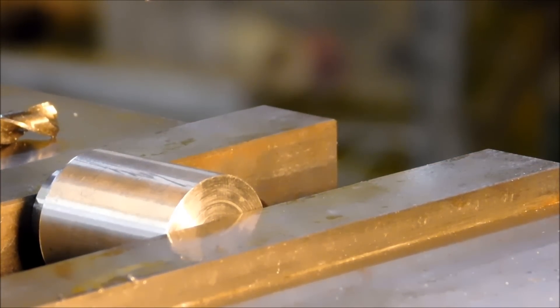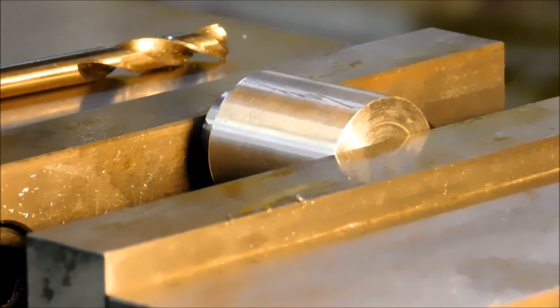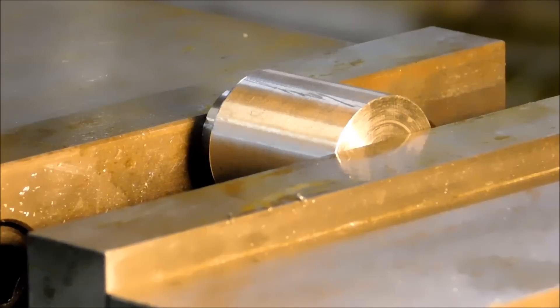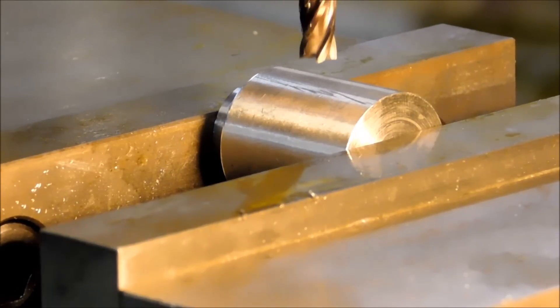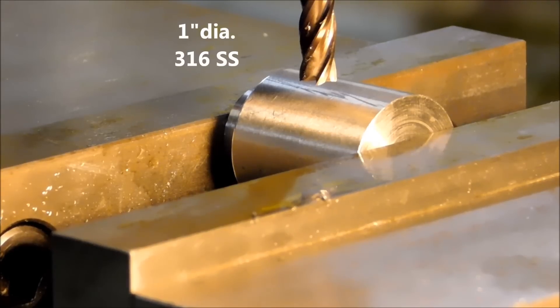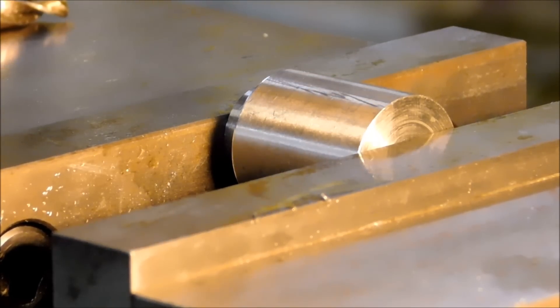Just make sure that's in focus for you — there we go, that's better. I'm going to walk drastically off-center here — worst case scenario, that's about as far off-center as you're going to get without breaking through the edge. Here we go, same process: get close, bring your stop up, do the rest of the work with a combined table crank and handle combination.